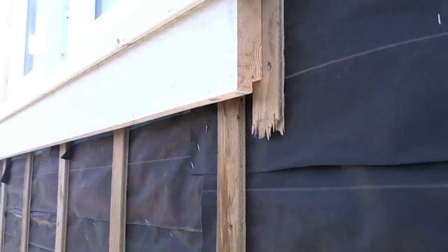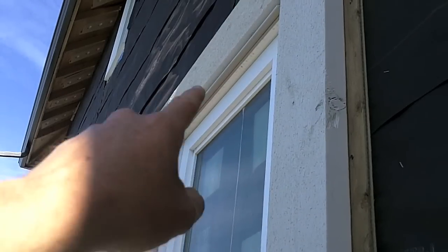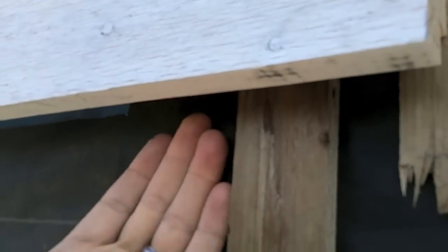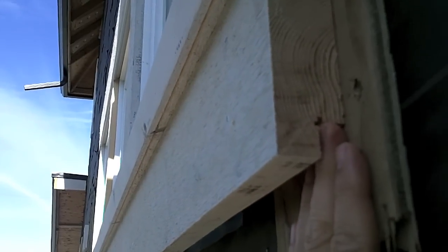When we put our siding on, we put our window trim on. There are a few things that we need to do with that too. We need to flash wherever we have a window. We can flash that with a tin flashing. We set our siding up on that same cavity there beneath. We also notch it, and this is the way that we cut our windows. We notch the bottom so our siding will fit up underneath so it looks right.